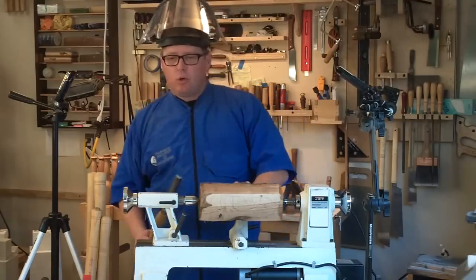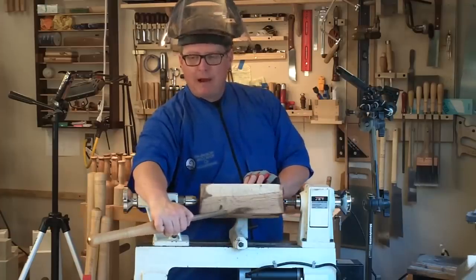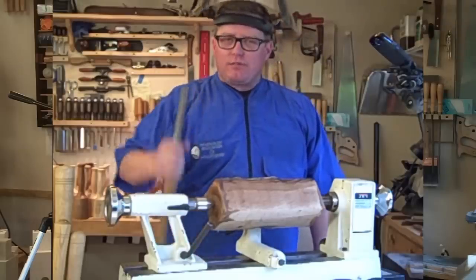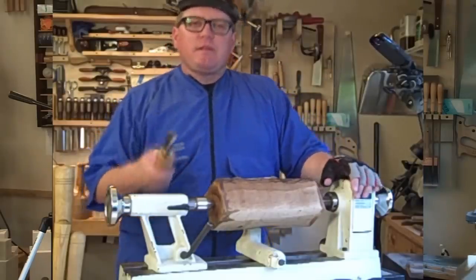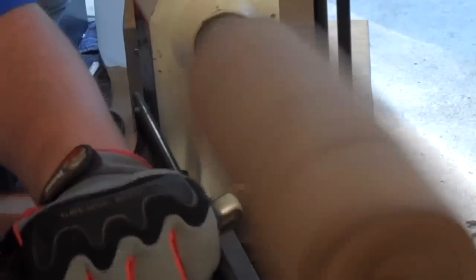At that point I simply lock that angle against my ribs, keeping the edge on the tool rest. You keep that tool rest at a height so you're engaging the wood at about the 50 percent mark — that means power transfer is hitting the wood and going straight down to where the tool rest is. Pivot off the tool rest, pivot off the bevel — two fulcrums to deal with. Something you learned in elementary school. Lock it against these rock hard abs and use your legs to keep everything steady.